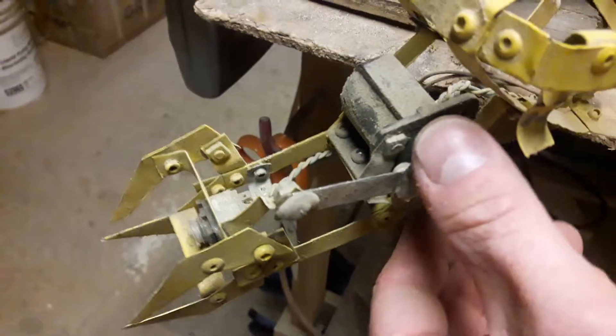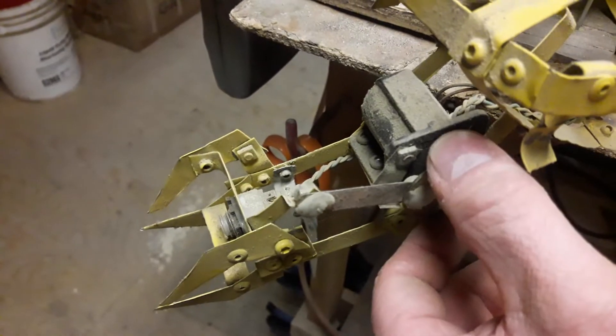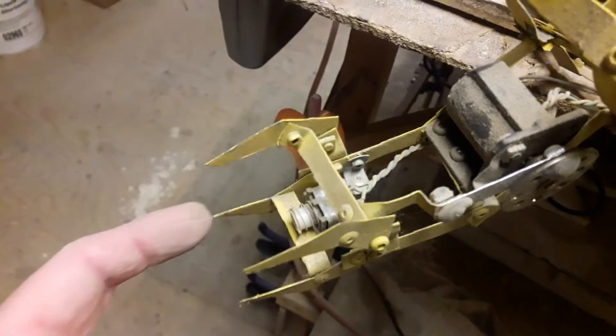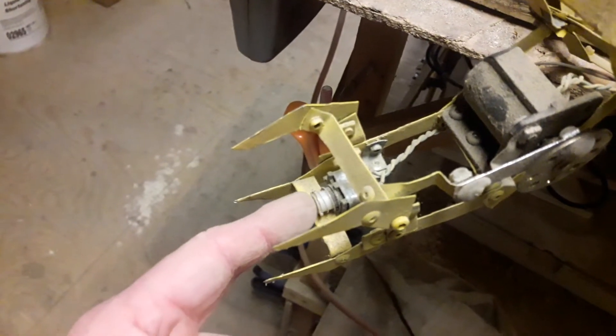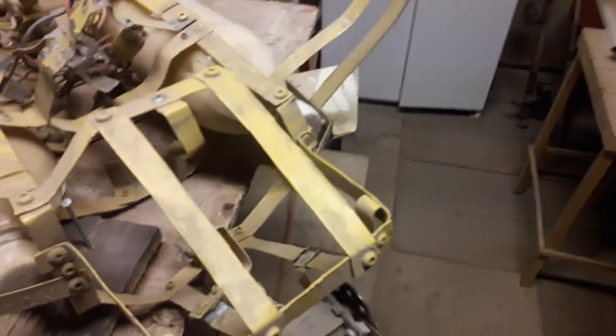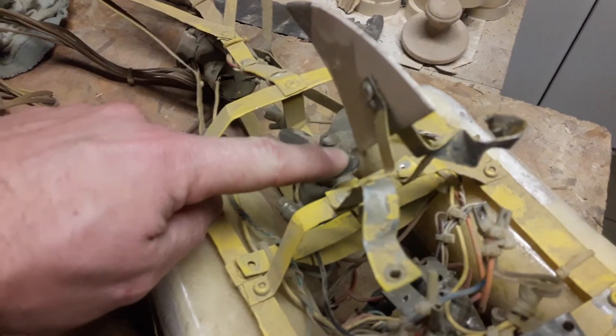For the front I made myself a grapple. The grapple consisted of this motor here, which essentially just closed it back and forth. The switch was a pressure switch — so when you grabbed something and pushed this, it would close. It would run off a nine-volt battery. Not everything was waterproof. I did wrap the motors in plastic and soak them in wax to keep them waterproof, and that did work somewhat.